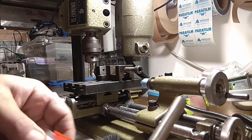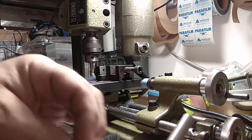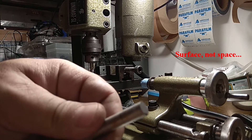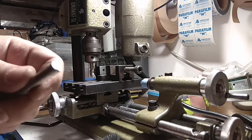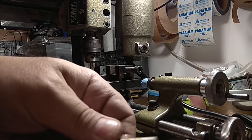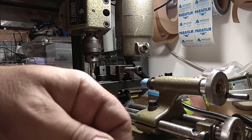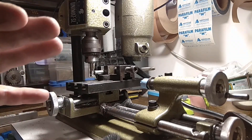I'm using these carbide inserts — let me try with the box focus, that's better. I've milled a flat space here; I'm going to mill half of it, long enough to generate enough space for the carbide insert, and then I'm going to drill a hole for it — a two-and-a-half millimeter hole that would accommodate a three millimeter tap.